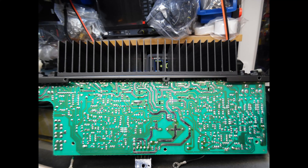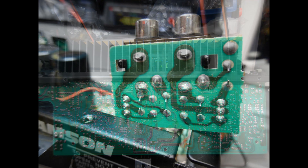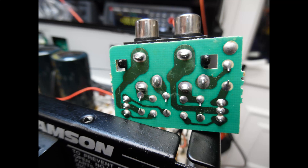On the right-hand side at the rear is a small circuit board housing the input RCA socket connectors. Remove the fixing screw, lift it up, and you'll often find dry solder joints on those RCA connectors. The metal chassis plate at the rear has a lip making access a little tricky, but once you get under there you restore integrity to all the solder connections and avoid secondary issues from bad joints.